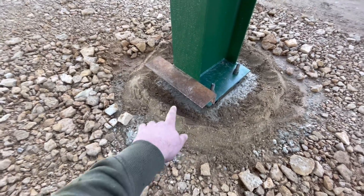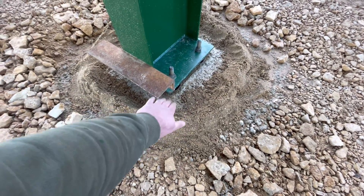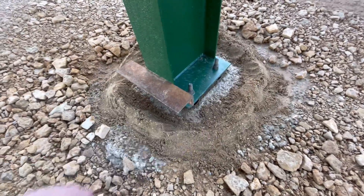I've put these bits on as well so the concrete walls sit on top of here so that the concrete can run underneath it, and then we'll shutter that side up slightly lower and then run it down so that the water can't come under the panels and up and in.